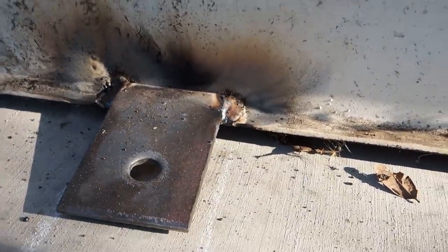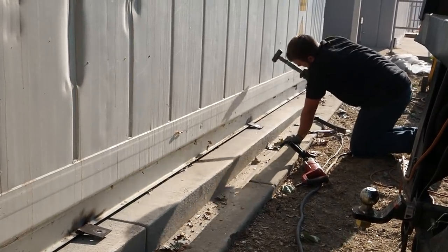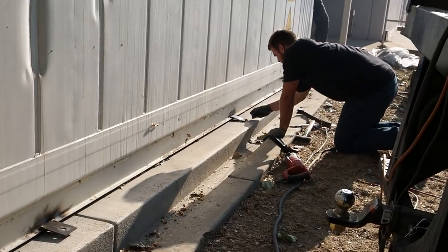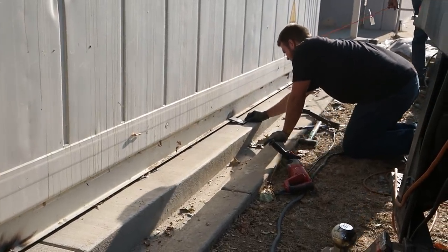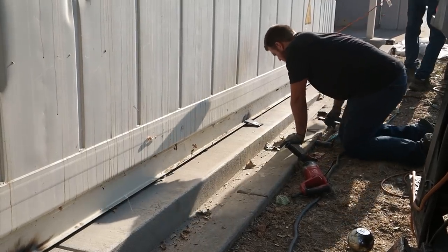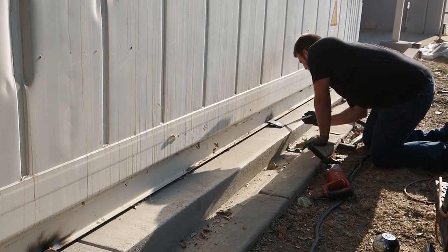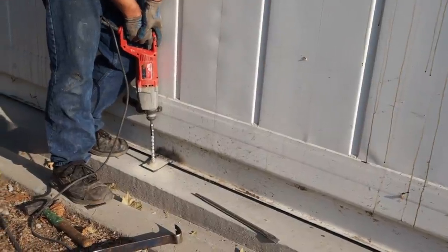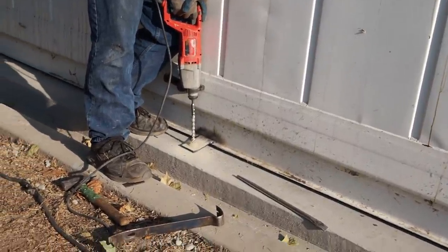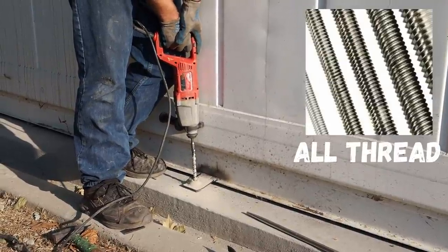As you can see, there are the side welds. Due to the lip being higher, we smashed these tabs down a little bit so they'd be up against the concrete and the all-thread could fit in there. The holes were oversized so we could have a bit of a tilt and the all-thread could still fit. We drilled the hole big enough on the tab to where we could put the final all-thread bit through.